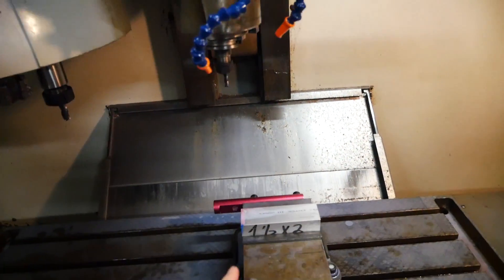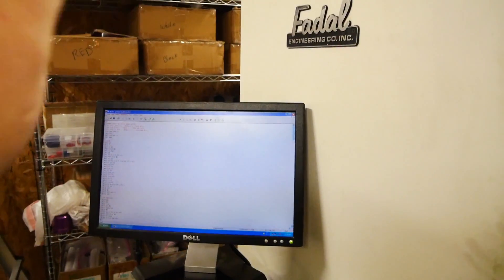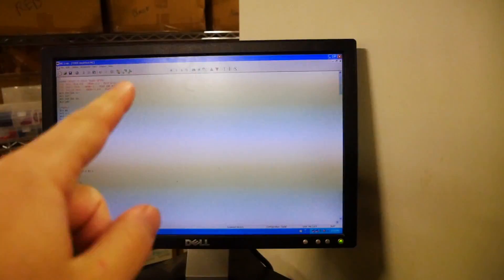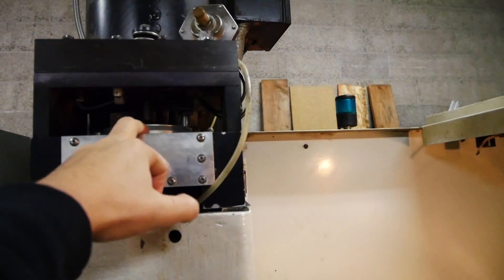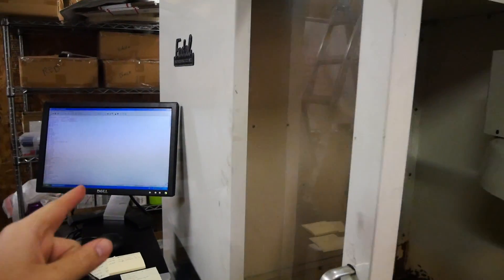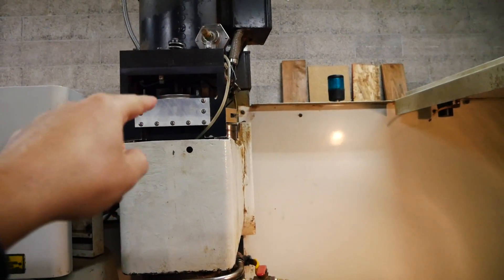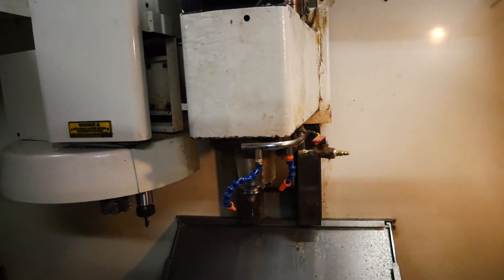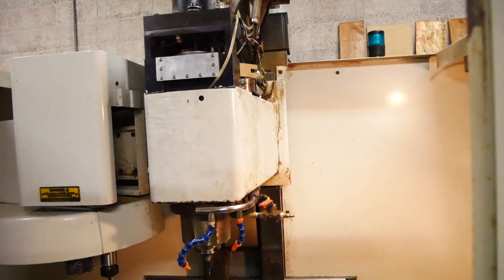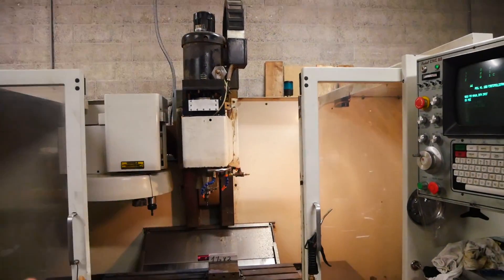I got all my tools loaded up - one, two, and three. I have my part in there and made sure it's all level. Got my new program in, went over it one more time in the office, made sure everything was 100%, then transferred over to NC Link and made some changes. This pulley is worn out so it's having a hard time orienting itself for tool changes. So I manually write in the code every time to switch it to low speed - on low speed it turns very slow so it can catch the orient and do the tool change. I'm putting the cover back on before I machine so chips don't fly up in there.